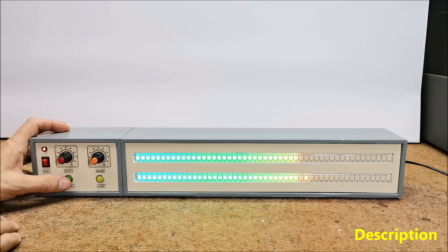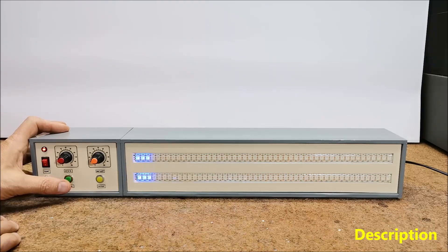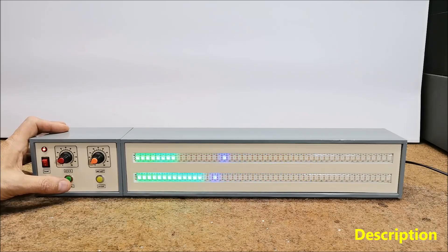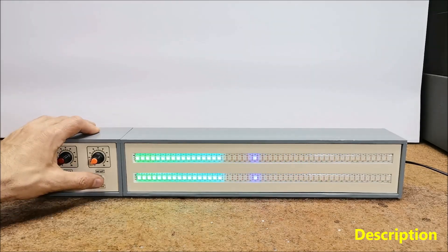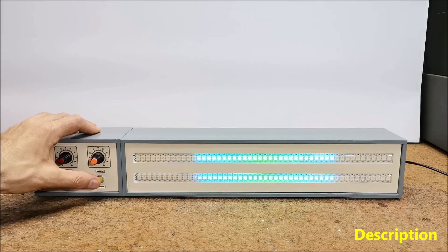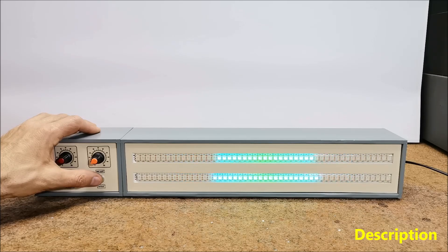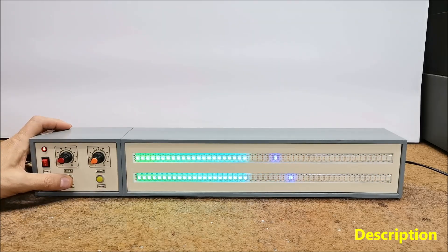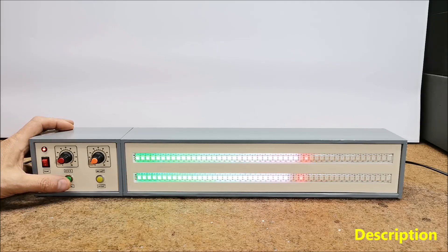This time I will present a way to make an advanced VU-meter which for indication uses 5050 type LED strip with built-in WS2812B chips, and the parameters of each diode can be controlled manually and individually. Thanks to the features of the LED strip, with a minimum number of components and relatively complex code, a VU-meter with many functions and visual modes can be made. The project was originally developed by Eric B. Creator and then repeatedly made and modified by many self-builders.